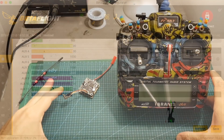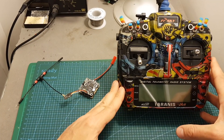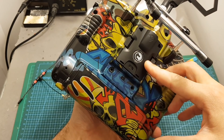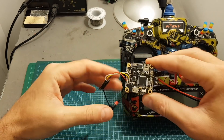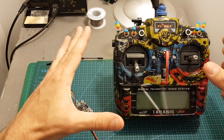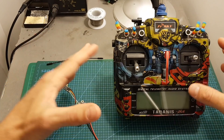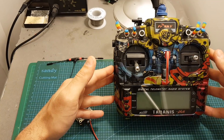So now everything is good to go. To quickly recap what we've done: first, update the Taranis to the latest OpenTX 2.2.1 firmware; then update the firmware of the Crossfire Micro transmitter; connect the receiver to the board and make sure you're running at least Betaflight 3.2.0; go through the binding procedure and update the RX; then configure the relevant ports in Betaflight. If everything goes smoothly it should take about 15 minutes. I hope this guide helps — thank you for watching, leave a thumbs up if you enjoyed it, and consider subscribing. See you in the next video!